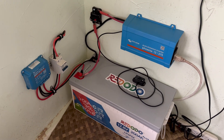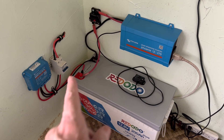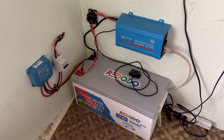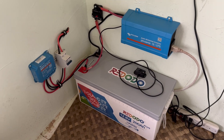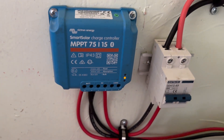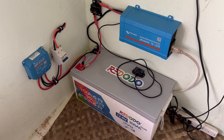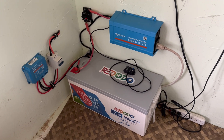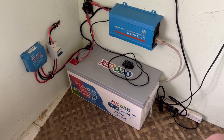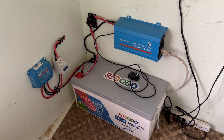It all went together very, very quickly. I did change the configuration just a little bit, but all those wires that I cut the other day I was able to use. I thought I'd maybe tuck the charge controller and the solar isolator switch back in a little further, but I moved it to where it works perfect for this little corner. It's up and running — as you can see, with that yellow light on the charge controller it just went into its absorption phase. Battery is sitting at 14.2 volts. It was pretty full — once I tied everything together, flipped the switch, and let the solar come back in, it only took 150 watt hours before it went into absorption mode.